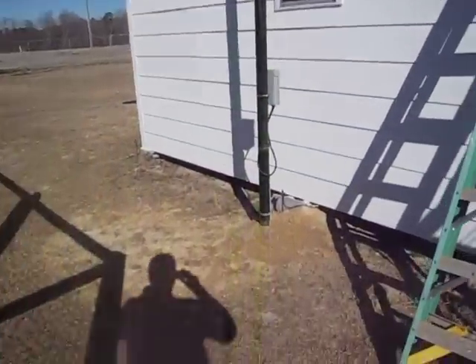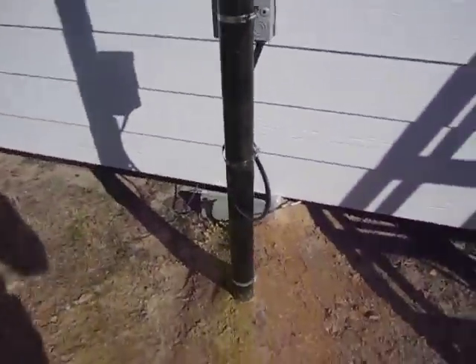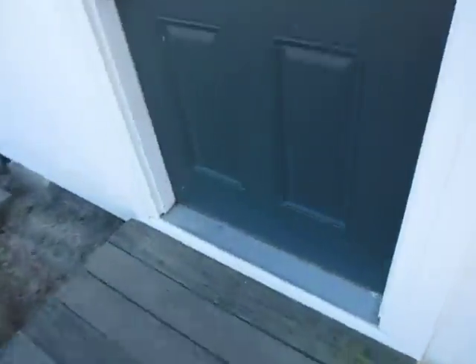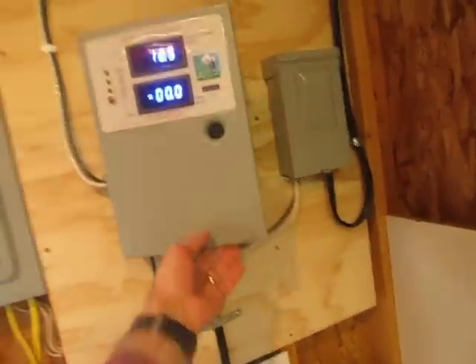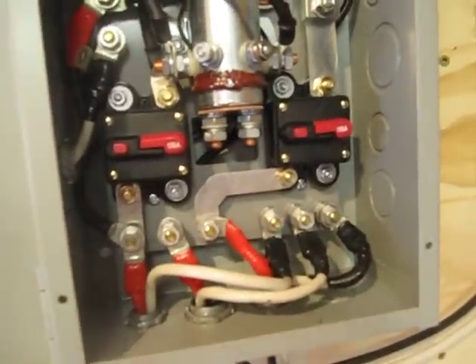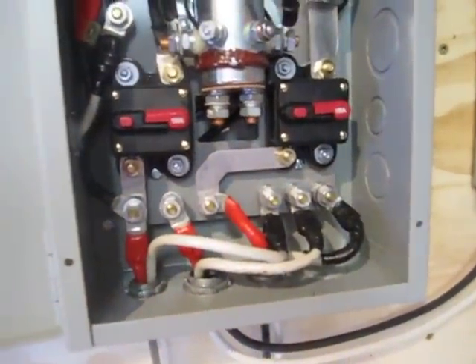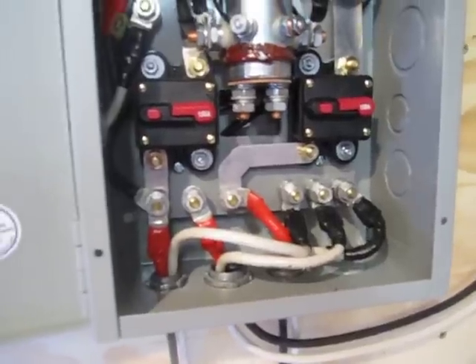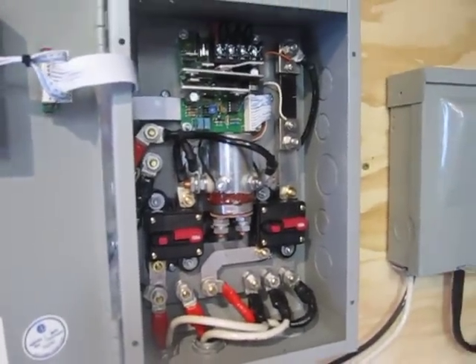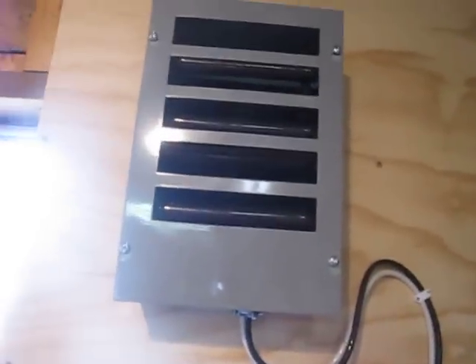Alright, let's go back in — there's the shutoff box. I'll show you the rest of the setup. So what I was showing you here was a charge controller. Here's the inside of their charge controller and it's a really, really nice unit. We've got amp breakers right here for the battery and for the wind turbine. It automatically diverts the energy to the resistor bank up here if we start overcharging the battery over 15 volts.